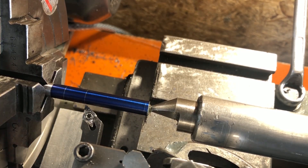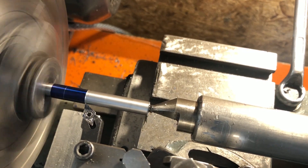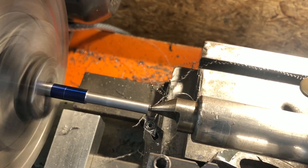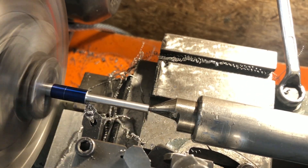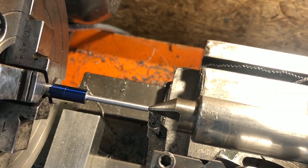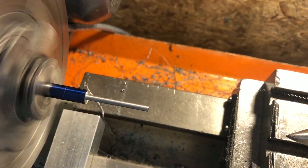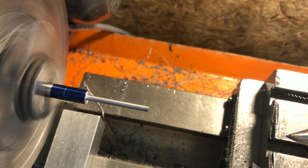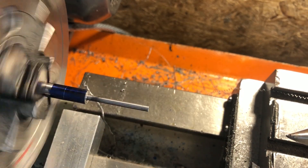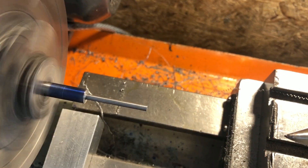With the carriage stop set, I can begin to remove material, constantly checking the part both for taper and for heat. I can't run these inserts anywhere near hard enough for the heat to be carried off in the chips, and on a part this small it warms up pretty quickly. The poor alignment to the tailstock won't be helping here either. One final pass, and we should be to size. Testing the fit on the body reveals that the part is binding ever so slightly in the centre of the stem, so rather than bringing the tailstock back in, I'm going to fudge it and remove what's necessary using 600 grit wet or dry backed by some mild steel bar.